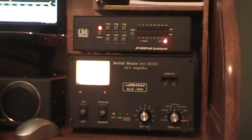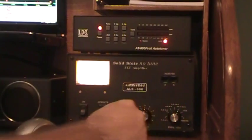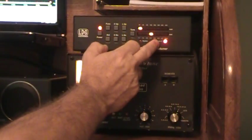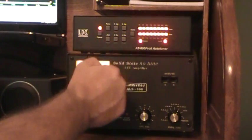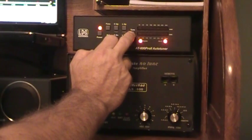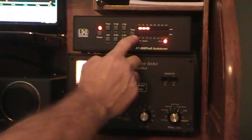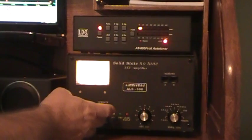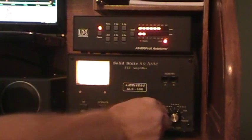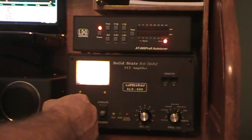The memory tune is what you would use the most after you've tuned a band. So say we're on 20 meters and a DX station comes up on your cluster on 15 that you'd like to work. Switch the radio to 15 CW. You can see there was 2.5 on the meter, so we tune that real quick. It's got it all below 1.1. Turn the amp on — getting about 1.3 with the amp, about 300 watts out on low drive. So it's an acceptable level.